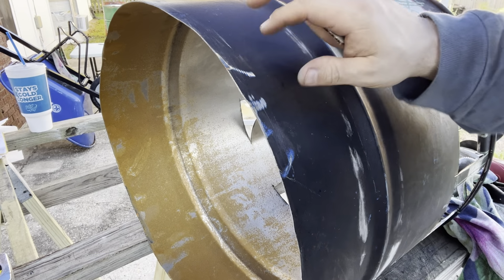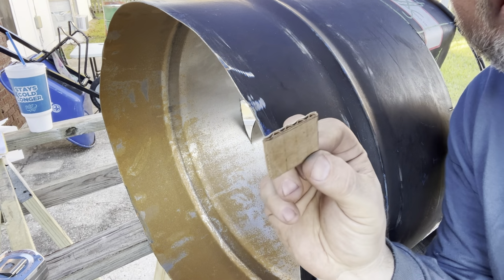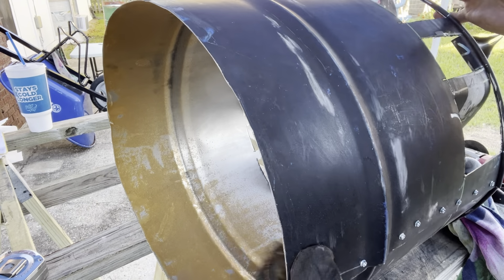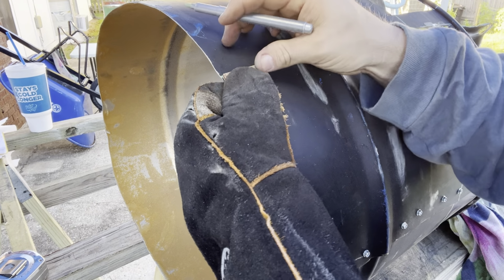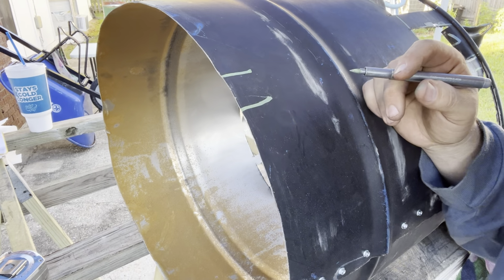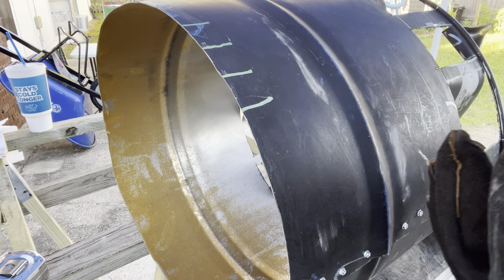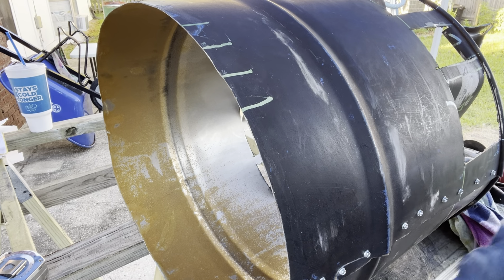All right, so along the top of the inner barrel, you're going to be making little slits. This is a 1.5-inch square little jig that I made, and along the top, and look how crooked my straight line is. I'm not a welder. What do you want? But you're going to be setting it like this. Boom, straight down, about 1.5 inches. Boom. Understand? And then do it again.